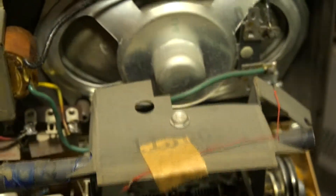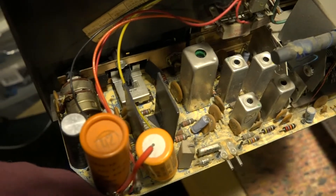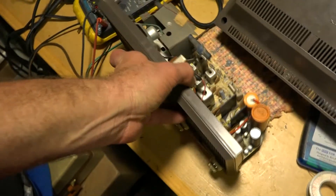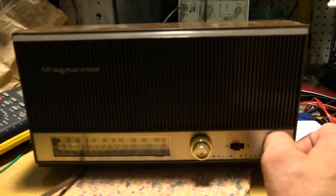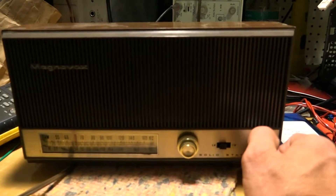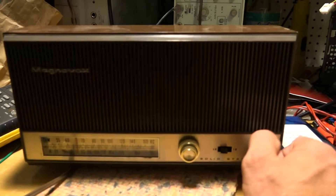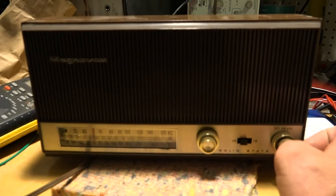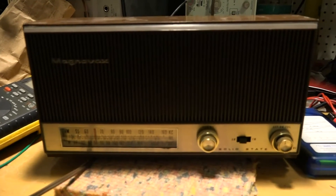There's a ground point here in the corner — I had to touch that up too. The metal plate the volume control is attached to was not very well soldered into the PC board. I got the tone control fixed by again touching up the connections on the tone pot and resoldering them. This radio is now working. There's a little bit of hum — one of the two sections in the paper cap is open — so we'll see about getting that replaced. Thanks for watching.